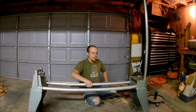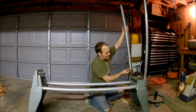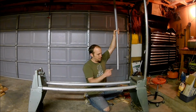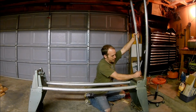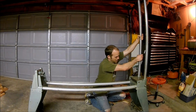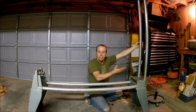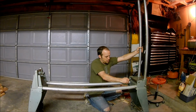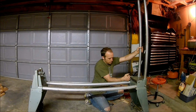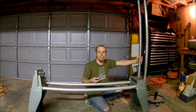and you get things cleaned up to where you want them, it's basically just a reverse of that. So I like to line up where I put my set screw before. So I'll take the same spot and put it on the same position, and then I'll just rotate it to slide it in there. And you feel it hit the bottom. That's where I like it to be. And then you turn your set screw to clamp it back down. And that should be set. That shouldn't slide around on you too much.